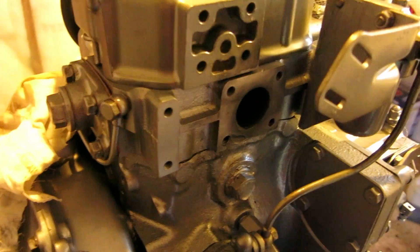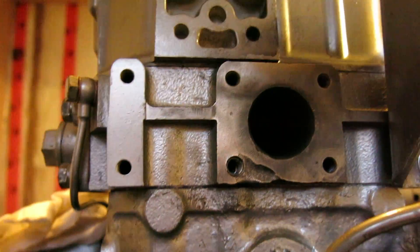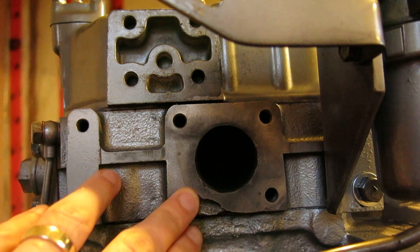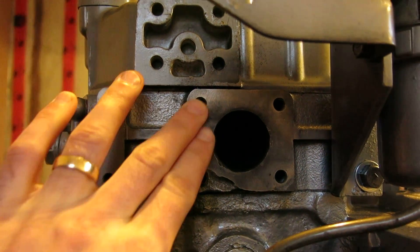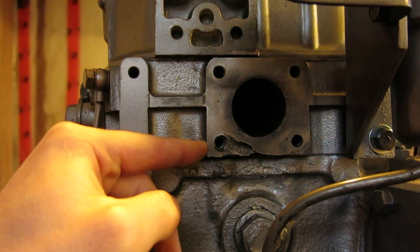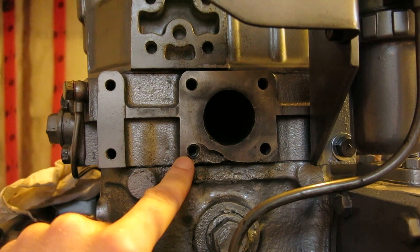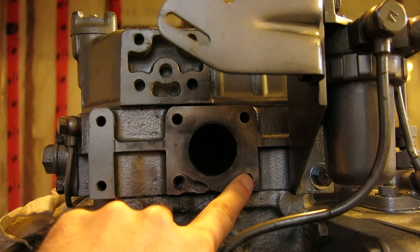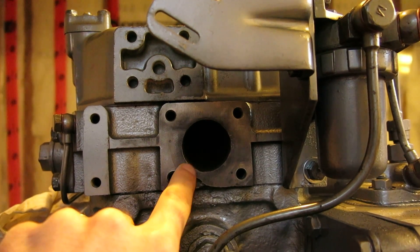There's no exhaust manifold on it right now - that's down at Precision Valve and Crank. I'm getting another one fabricated. As you can see there's a bit of pitting here; when we got the engine it was rusted out, including this bolt hole here - it was in pretty rough shape. Precision Valve and Crank planed that down to try and get a nice flat surface. The problem is there are two different types of exhaust mixing elbow you can get for these things. There's the standard three-bolt - despite there being a four-bolt pattern in the head, the standard exhaust manifold is three-bolt, bolting into these three holes here - and there's not enough pressure on the gasket.